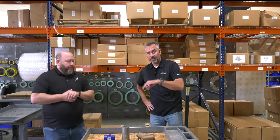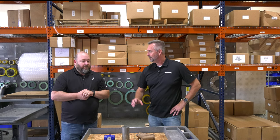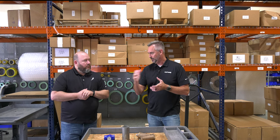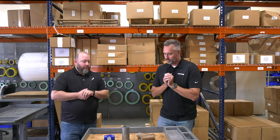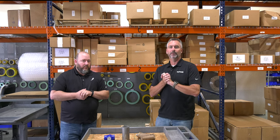Make sure you take a look at what you have in your system. If you don't have something before a control valve and you've got some dirty fluid, steam, or whatever it is, you want to make sure that you put those strainers in line to protect those control valves or whatever it is. Appreciate the information, Brian, and we'll see you next time on the Boiling Point.